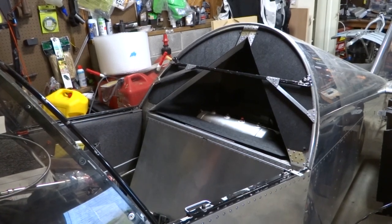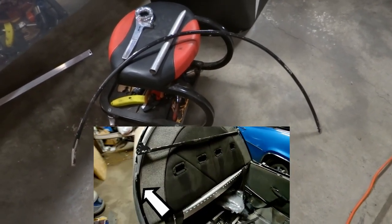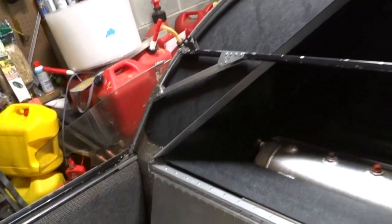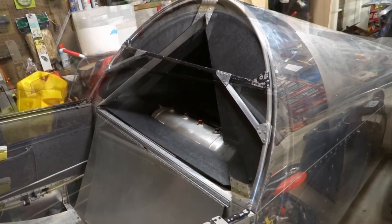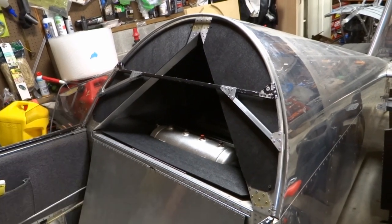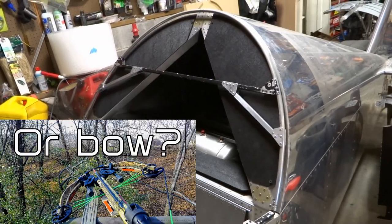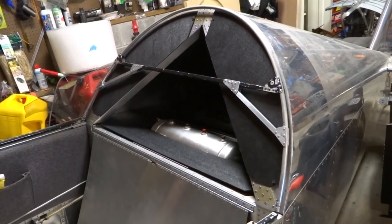What I just got done and I'm pretty happy with is the canopy frame. As you know from my overview video, a gust of wind took the canopy and shattered it, and in the process broke the rear canopy bow. This is what the new one looks like installed. The bow comes in pretty bent but it's not exact to what the Sonex needs to be. Luckily one half of my old one was still in proper shape and I was able to match it up to the turtle deck pretty well and get good measurements.